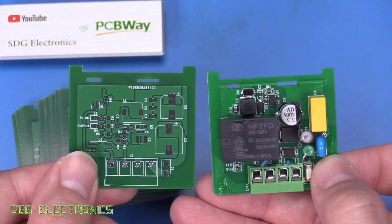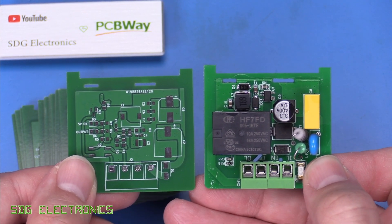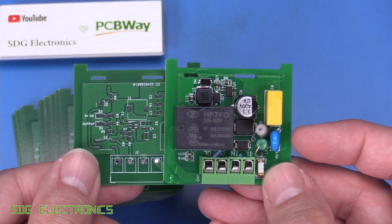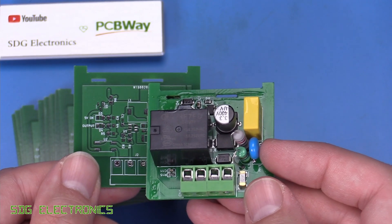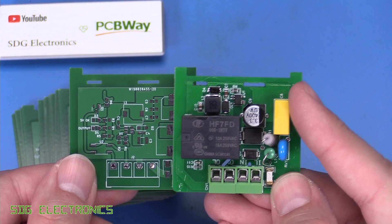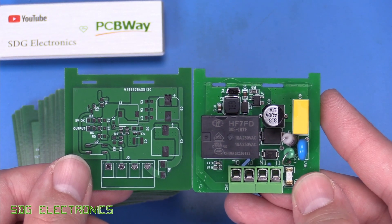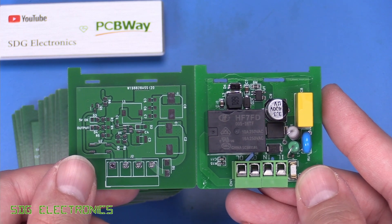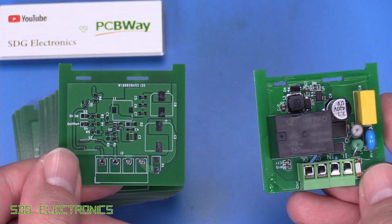This is the PCB that it's replacing in those millimeter wave sensors and it looks like we've got all the measurements right. The terminal block is in the right place, so it should end up in the housing in exactly the right place. The only thing I'm noticing is these slots which the sensor board slides into — they look a little bit narrower than the ones on the original board. So I might end up having to open these up very slightly, which is a little bit unfortunate, but I should be able to do that with the Dremel and some dust extraction. But other than that, I think they're looking pretty good. So let's get on with the assembly and then we can give these a quick test.